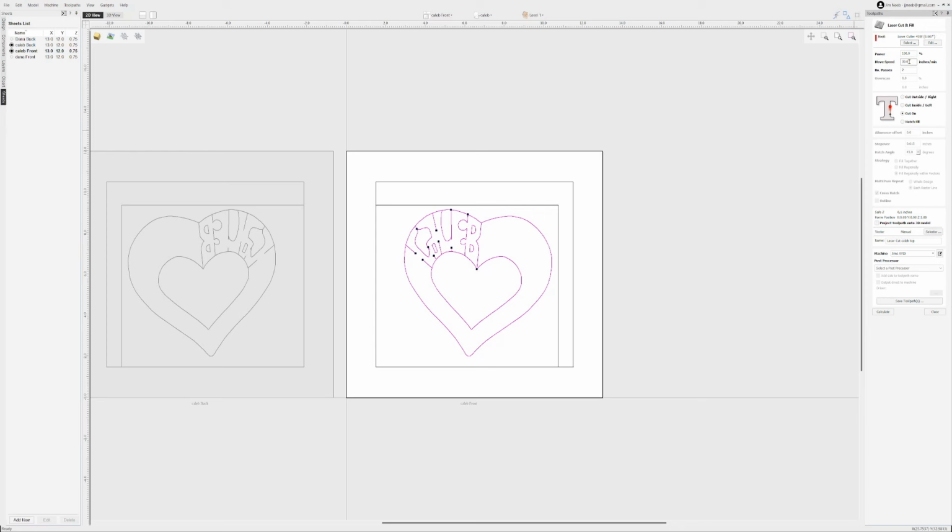So I dropped down to 25 inches per minute on the next one that I cut out, and that worked a little bit better. Two passes at 25 inches per minute and 100% power easily cut through halfway, so it's a little over 3/8 of an inch. Easily cut through that in 2 passes. It's a lot cleaner to cut if you're moving faster.